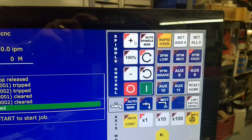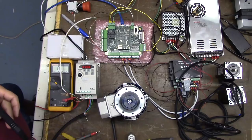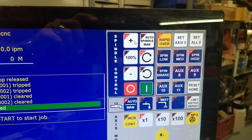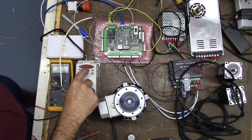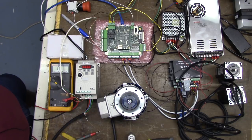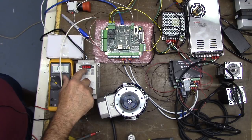We're going to click the plus sign — there's a plus and minus sign. It defaults to low. Let's hit 100%, which is halfway. And you can see 30 hertz on the VFD display. So 100% is half speed — we're at 30 hertz, we're at half.